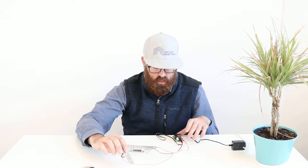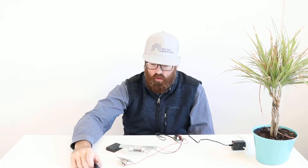Basically, you could remove these two contacts and this thing would still function with the remote control. Overall, I like this electric strike system — it's a great little system. If you've got a house with a front gate, this is very easy to wire up. You really only have to wire the power supply to the electric strike and then use the clickers, which I think is going to get 99% of people what they need.